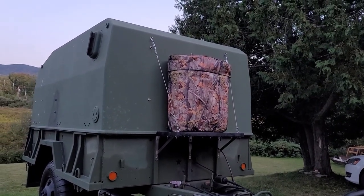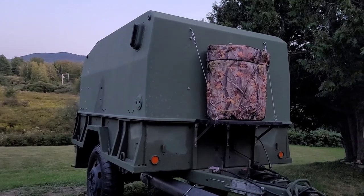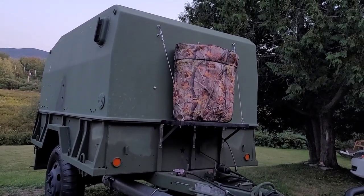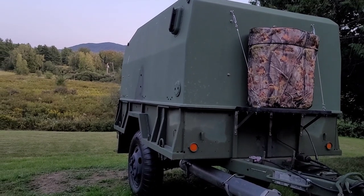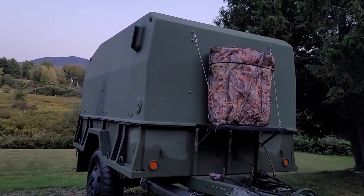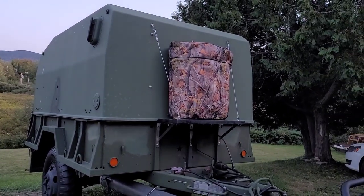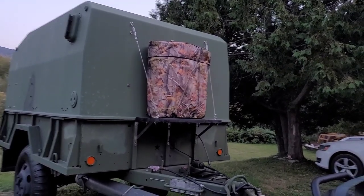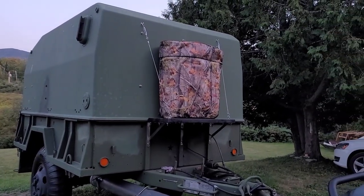Before I went to Amazon to purchase the various lines and fittings, I really wanted to think about what I'm going to run with these two tanks. I have generators and propane appliances. The generators are both dual fuel — I can run either propane or gasoline. The smaller generator is a 4,000-watt Champion digital hybrid inverter, which produces a pure sine wave signal so I can run electronics without damaging them. The 12,000-watt Duramax is for when I need a lot of power. The Duramax has a 3/8-inch fitting and the Champion has a quarter-inch fitting, so I had to keep that in mind when designing the lines.